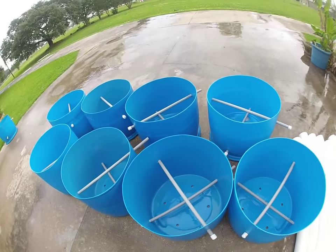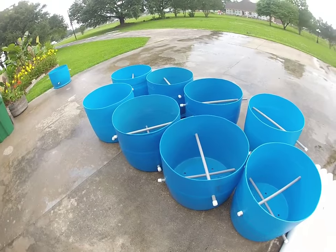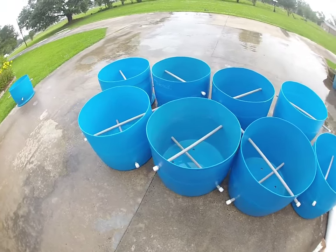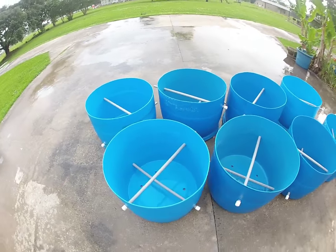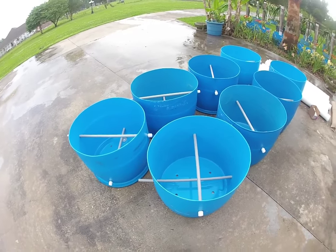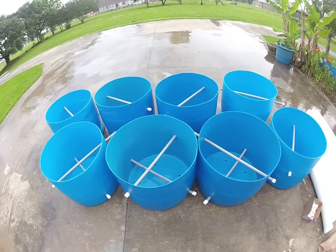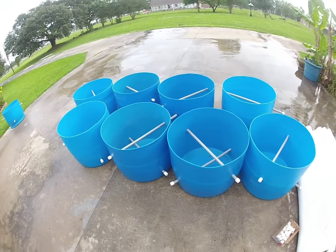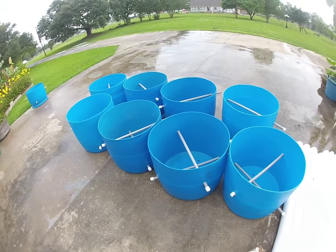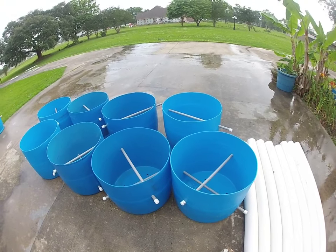In this phase I went ahead and installed caps on the inch-and-a-half conduit because I don't want any critters getting in the pipes and making nests. It's an extra expense and not strictly necessary — you could use something else to block it off — but I just use the caps.